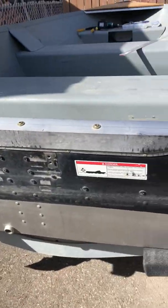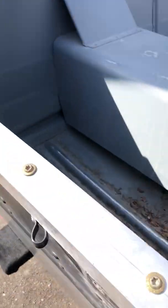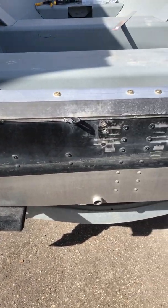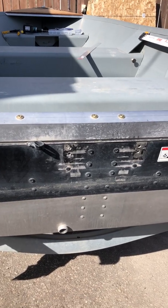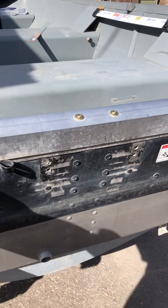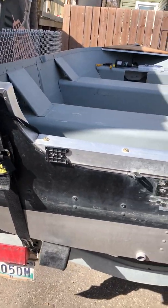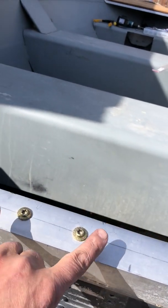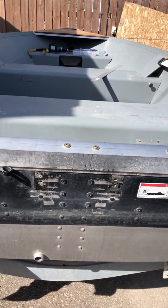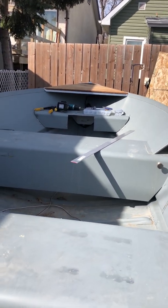You can definitely comment and let me know what you think. One other thing I did — actually last year — this transom, especially on the Smoker Crafts, they build it really thick and fully sealed, which is really nice. The only thing I found with my Suzuki motor is that when it sits on the base it sits really far down. So I basically measured how much I needed to raise the cavitation plate to the base of the boat, went to a metal fab company and got a custom aluminum bracket, custom cut it, filled it with foam, sealed around the edges, and put structural bolts in. The actual bracket will sit over these so it's not going to affect the leveling of the motor itself. So far I had it working pretty well — this is the progress so far, and I'm going to do a little bit more work and take another video in a bit.